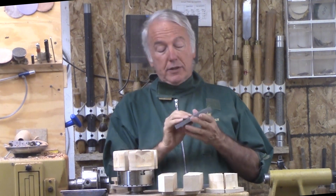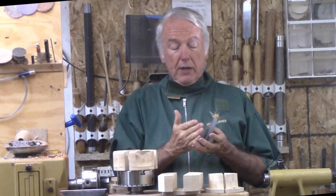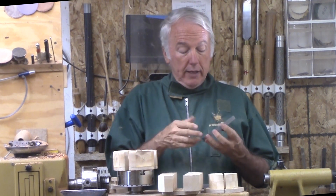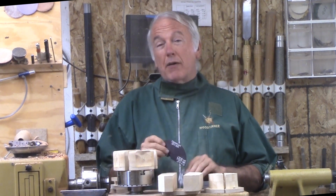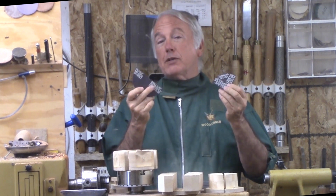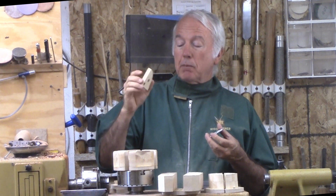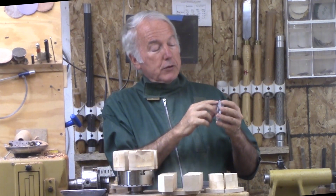The other thing is, in order to use this effectively, I needed to put bolts or screws through it, and those would come into the wood, and I get nervous about screws in wood where I'm turning. So I have backed away from the 3D print to salvage my work. I've flattened them in effect and made this into a template, two different styles of templates. I've chosen half inch Baltic birch plywood to make my flat, blank chuck jaws out of. So I've got all those notes here.